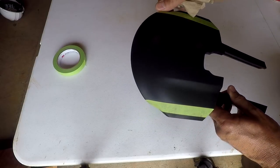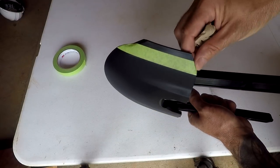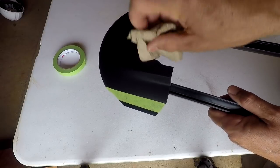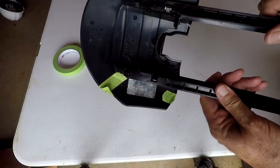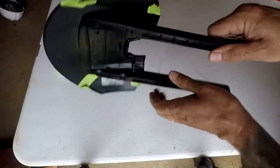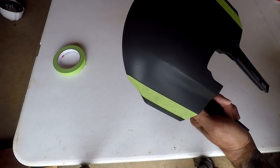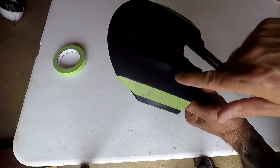So that looks taped off. Now I'm just going to wrap this piece with some more tape — I don't want to bore you with that. This whole thing will be primered gray and I'm going to come up this way too so I don't get it all covered in red. I don't care about the underside — I want to use these as handles so I don't have to touch the part. That's how you work it. The main key is to sand it lightly — you can see it's a little scuffed.